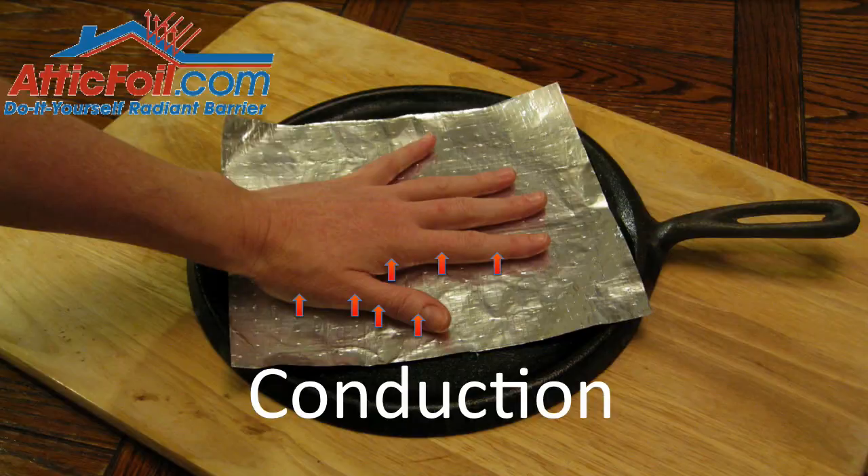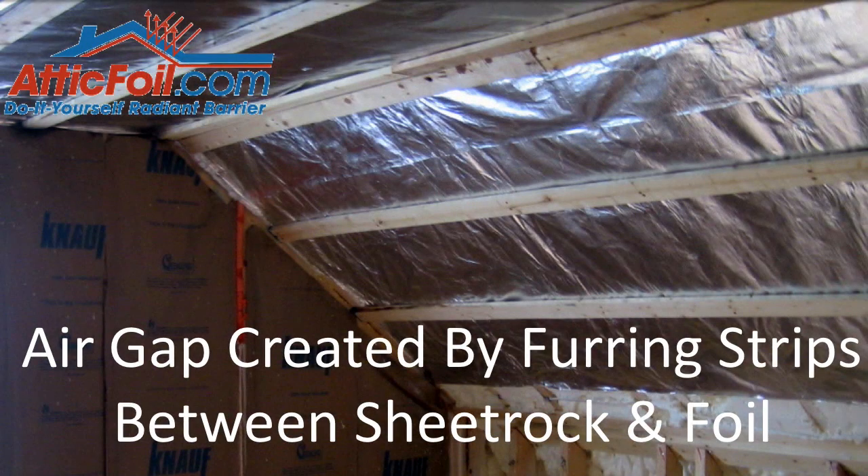Another example is in walls. People often think that they can put the radiant barrier just behind the sheetrock, between the sheetrock and the insulation. This won't work. Insulation is not an air gap — think of nothingness. You've got to literally have a void. Insulation technically is a solid with a lot of air in it. So if you're going to do a wall assembly, you've got to create an air gap. It doesn't matter on either side — it's going to work either off of reflectivity or emissivity.